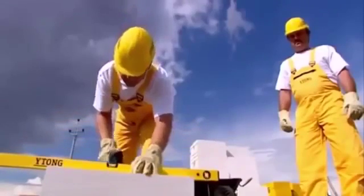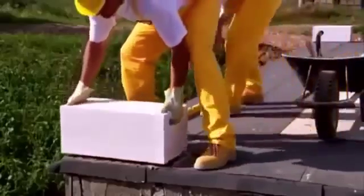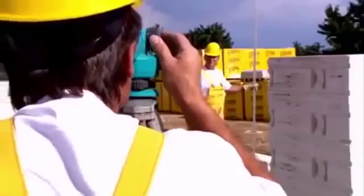Layer of lime cement under the whole surface of the block. Make the block stable by tapping on it with a rubber mallet. At the same time, check the block is level in both directions. Using a spirit level, check the height setting of the blocks in all corners.